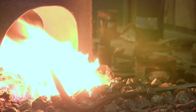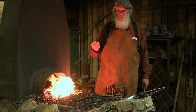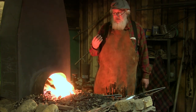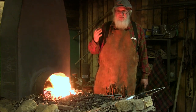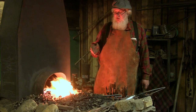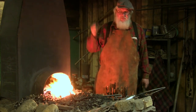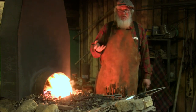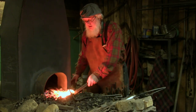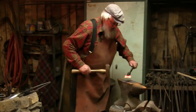The reason we insert a piece of carbon steel is it has the ability to be heat treated and tempered. So once we get this thing finished, the edge will be able to maintain a good sharp point without going dull too quick. And the body of it being softer iron will absorb the shock of the blows when you're using it without being riddled or cracked. And this is the way axes and tomahawks have been made for thousands of years.